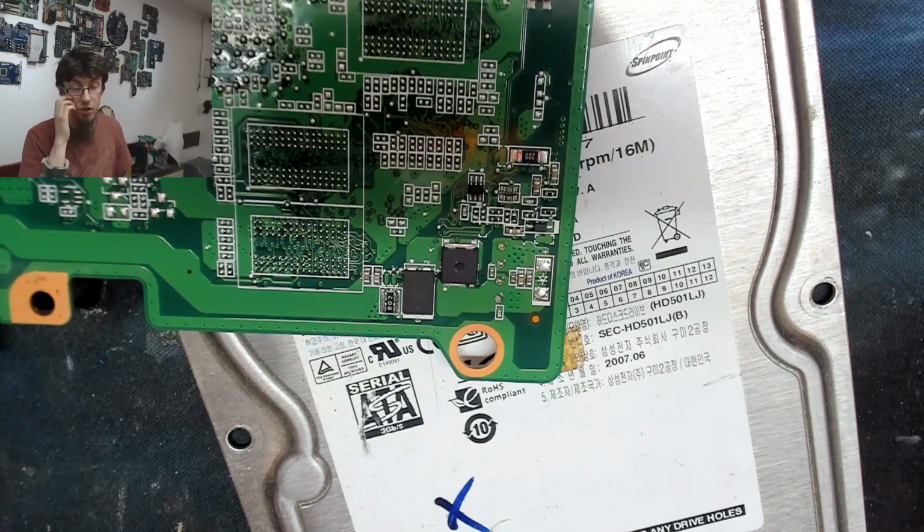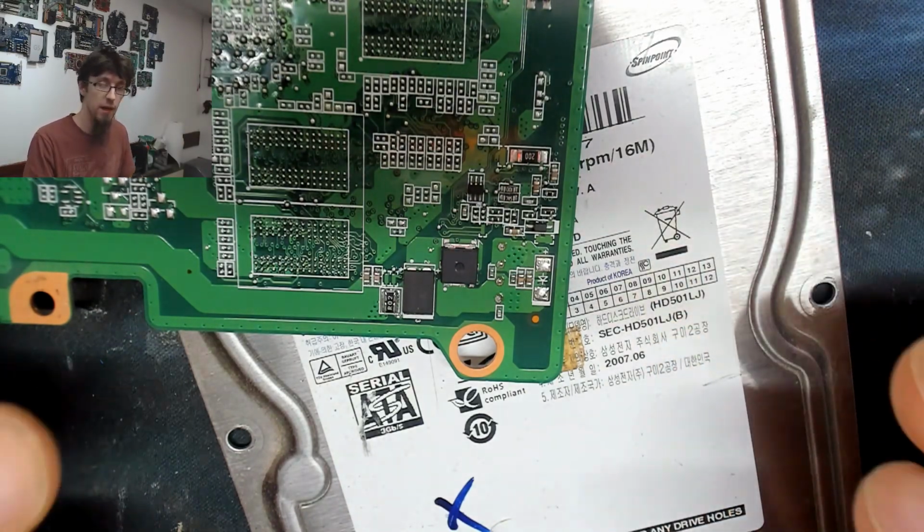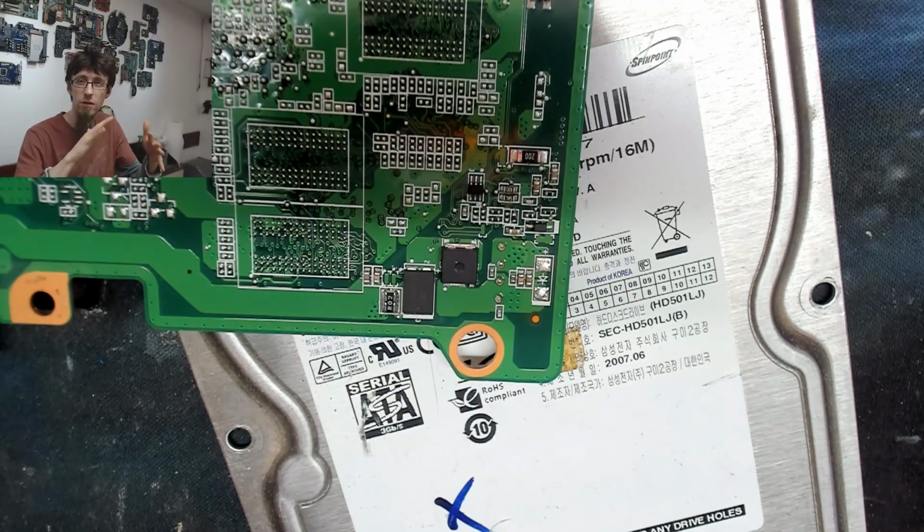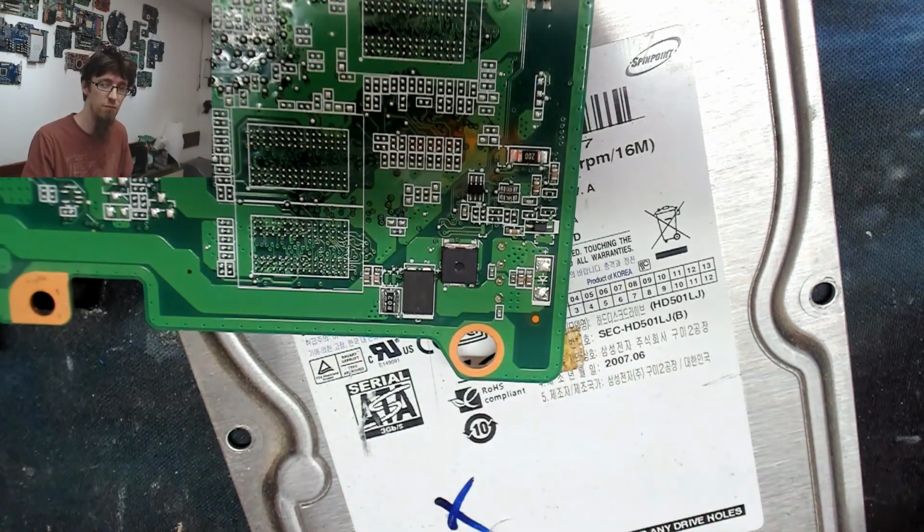Okay, we're going to wait for the board to cool down. We're not going to take readings while the board is sizzling hot, because when you heat the board up, the board will probably flex, and that may cause things to touch that are not supposed to touch. I've seen short circuits appear and disappear through heat cycles, so you generally want to let the board calm down a bit. It doesn't have to go down to room temp, but just not be at 400 degrees, basically.